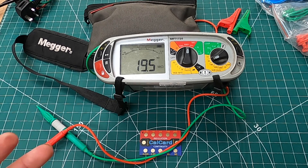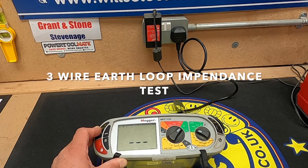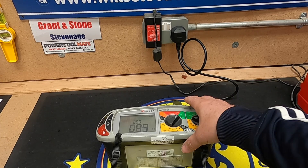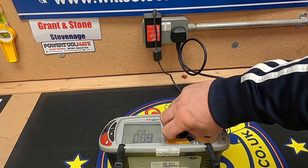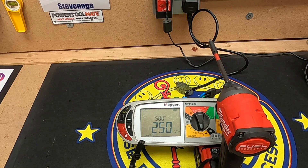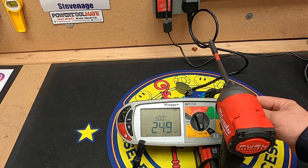What I'll do is move over and do the RCD and loop impedance test. I'm on a fused spur because it's RCD-protected. I'm going to set it to automatic and go for it. I just need to check what type of RCD it is — I'm 100% sure it's AC. I'll turn it round to auto and stand by the consumer unit. It's on auto and it's going to do the five tests.